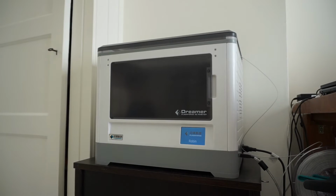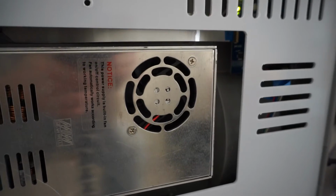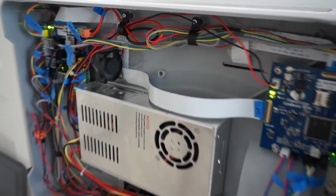When the printer is in idle mode, while you are for example uploading files or heating up the nozzles, the printer is already making some noise, at least some of which seems to be caused by resonance in the plastic housing of the printer. At first I thought the fan of the main power supply was blowing when the printer was stationary, but it is actually the small fan used for cooling the driver board. This fan is always on from the moment you turn on the printer.